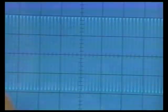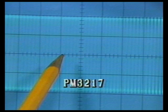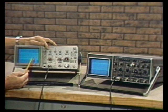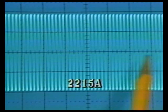This can be a problem when measuring high frequencies where waveforms are closely spaced. At low drive on the PM3217, we can distinguish the waveforms to some degree, but they're dim. As I turn up the intensity, it becomes a complete blur. On the Tektronix 2215A, at low drive you can distinguish the individual sine waves, and as I turn up the intensity, the trace remains sharp. For trace brightness and sharpness, the Tektronix 2215A is superior to the PM3217.